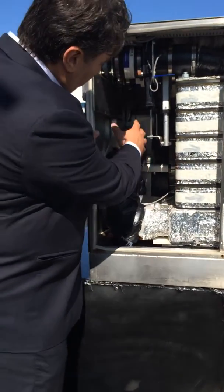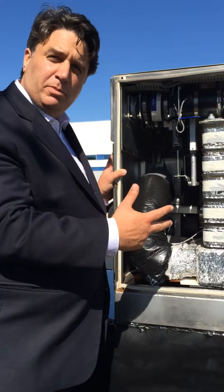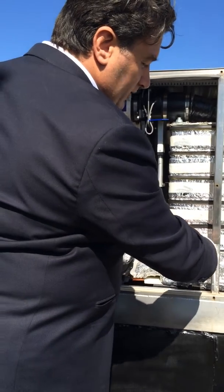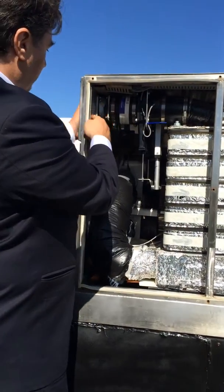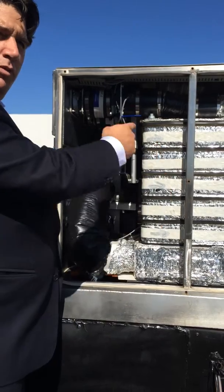Vents, okay? There's some fans that'll blow, and this is at nighttime, so remember there's a three-phase process. The absorption phase at night will bring the air in, and it will run that air across the desiccant stacks, up, up, up, and then ultimately right out these fans and out the side. And this absorption cycle will happen over and over and over.